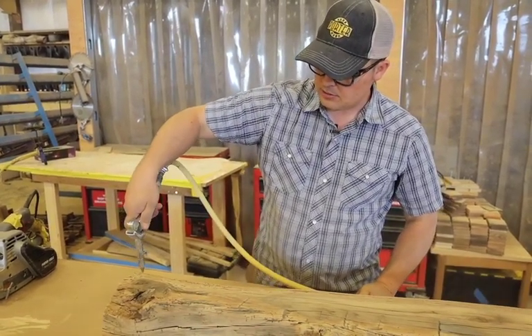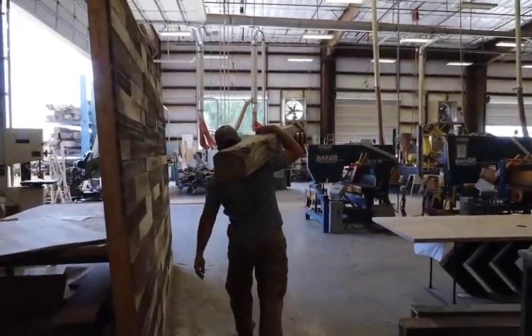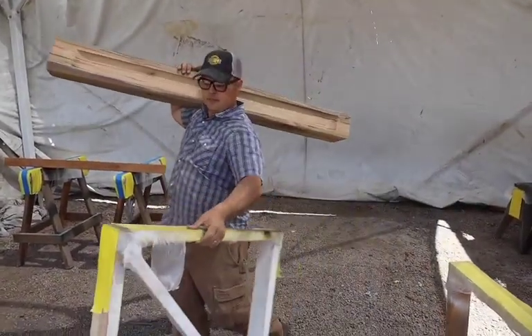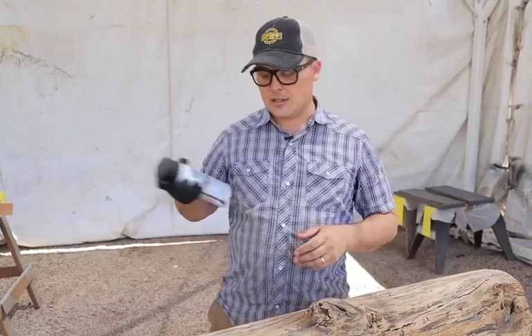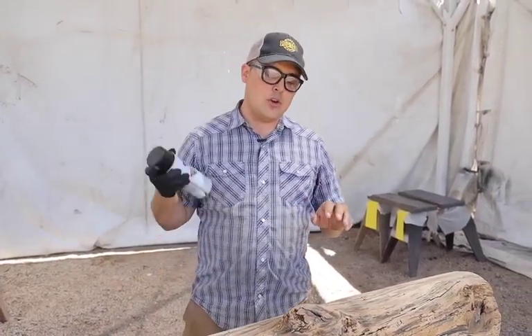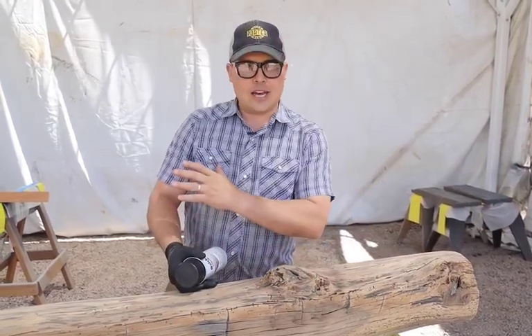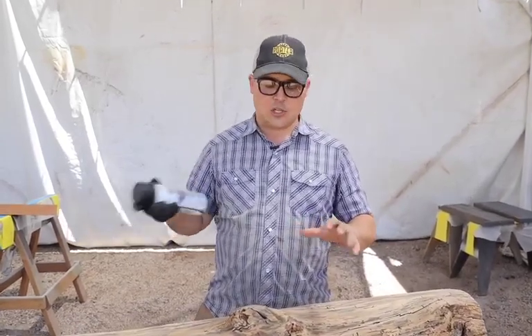Inside every one of these little beetle holes is little sawdust that's been there for a long time. I'm going to hit it with air just to blow out the junk so it doesn't fall out after I finish it. You can do all the different Minwax colors, and if you want to do a wipe-on there are all sorts of ways to make this colorful and beautiful. But I want a little contrast, so I'm going to do something that's more of an industry secret. In the Home Depot paint section you'll find this cheap quick-color stuff — it's like 99 cents, and it's a really thin black spray paint. What I'm going to do is create contrast by first wiping the entire thing in black paint. When I come back over it I'm going to clean it off with acetone, which will clean off all the paint on the surface but leave all the black in all the little places inside.